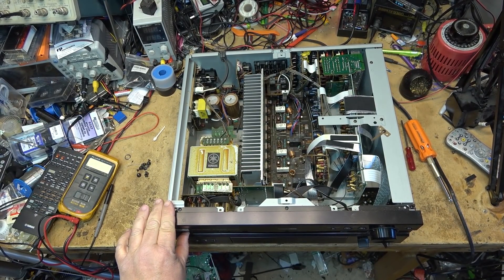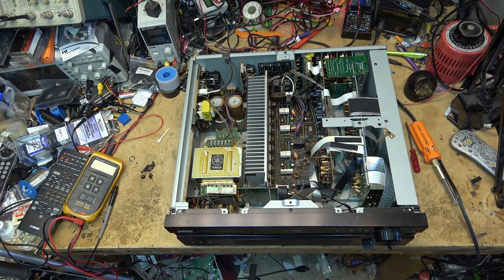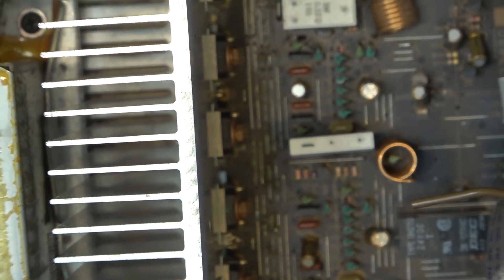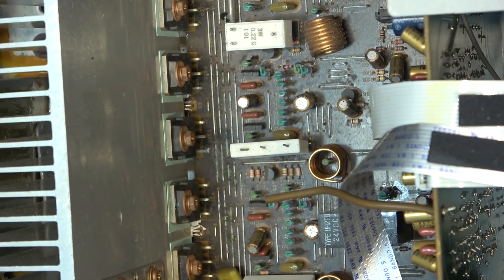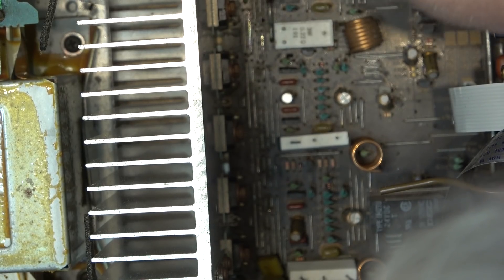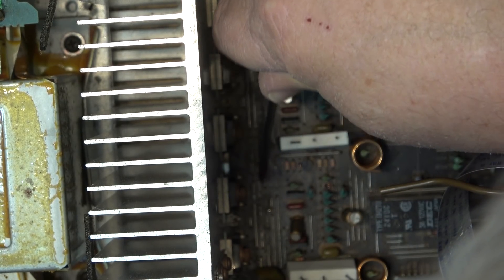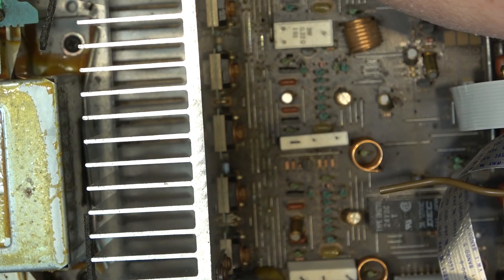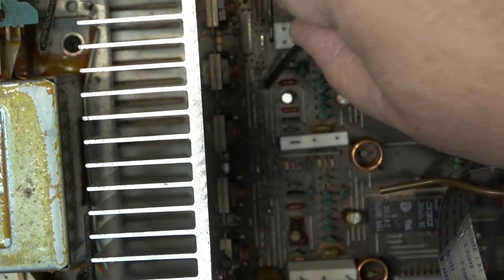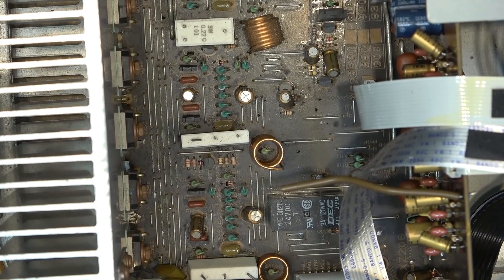Let's see if it'll turn on now. Nope, still shutting down. So we have a problem. I still see lots of crud on the board — residue. These are all metal straps that bridge things together, and there's probably leakage between them all. There's a good chance that there's some components that have failed too due to these bugs shorting themselves out and moisture. I'm going to clean the board off a little bit, try to scrape between all of these trace overlays, make sure there's nothing shorting out, and then we'll dig a little deeper.